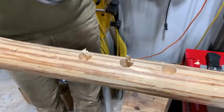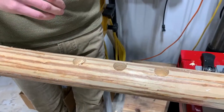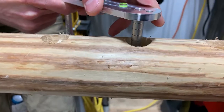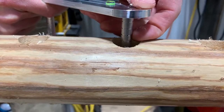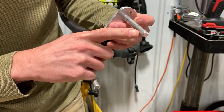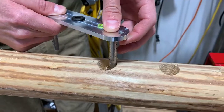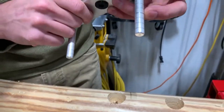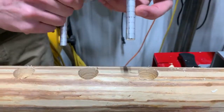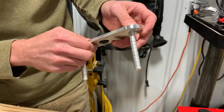Now we can check our hole depths. Make sure you've cleared out as many wood chips as you can, then take your pegs and just by setting it in the mortise hole you can get a quick estimation on the depth. Since these are quarter inch increments — one, two, three, four, five, six, seven — that is an inch and three quarters. This hole here has four rings so that's an inch long, and this one has five rings so that's an inch and a quarter. The depth gauge is a quick way to find out how deep your mortise holes are.